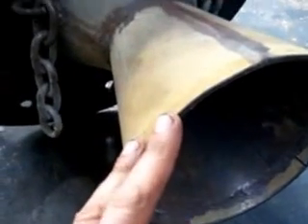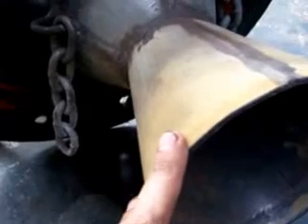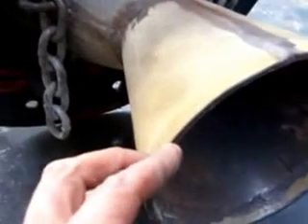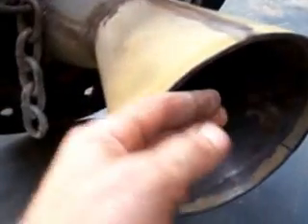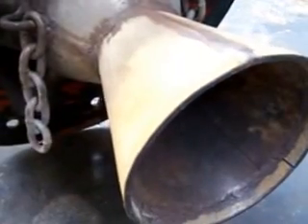I'm going to give that more room because I did find the motor was jamming up. Once I pulled this out, I found that I didn't take into account the fact that heat expands things. So when the grate was getting hot, it was rubbing up against the bottom of the cone here and jamming it up. A bit more room will be better.